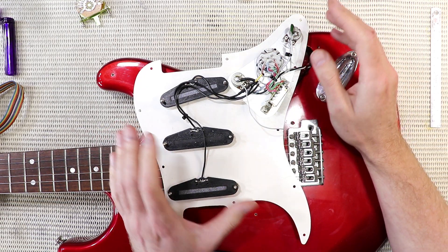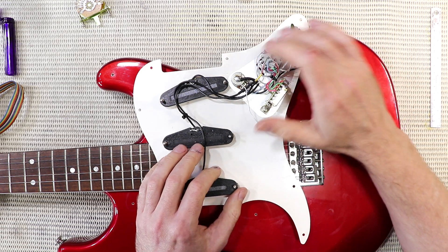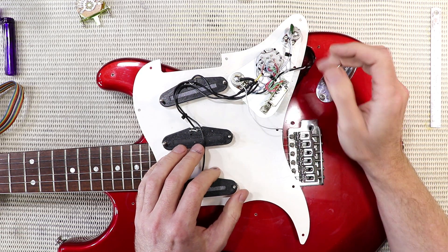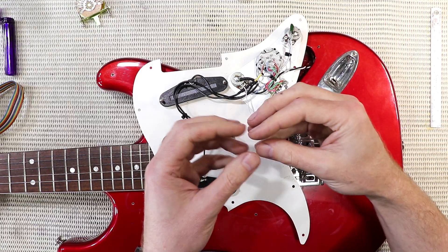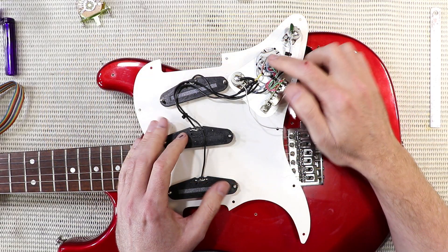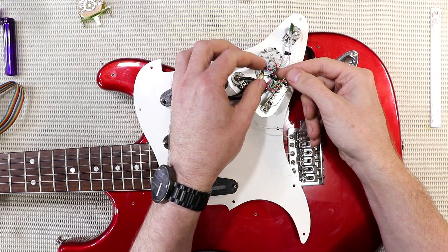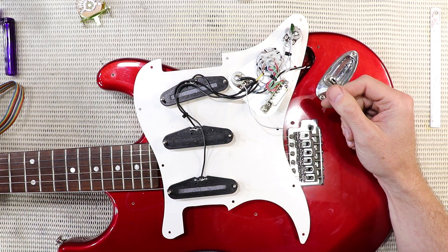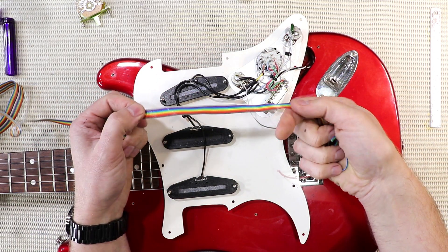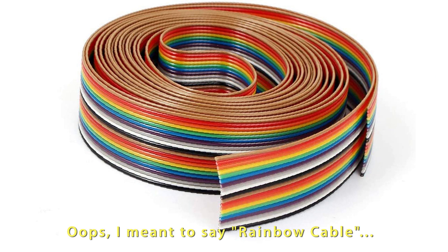Now, if you're planning to wire this up, there are a couple of considerations. If you're going to try and wire something as complex as this switch with that sort of heavy cloth-coated wire that pickups often come with, then forget it — it's just going to be too thick and difficult to do. You notice I use kind of skinny coloured hookup wire. I normally buy what they call ribbon cable at my local Jaycar and just peel off the colours as I need them.